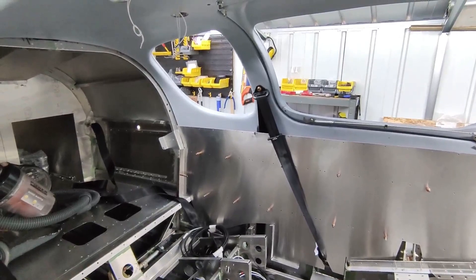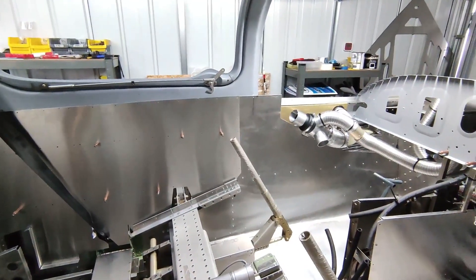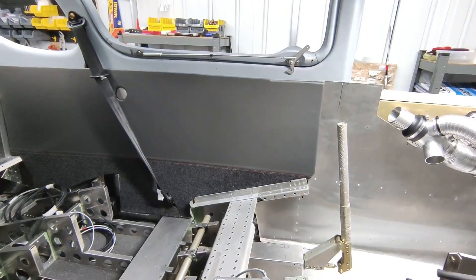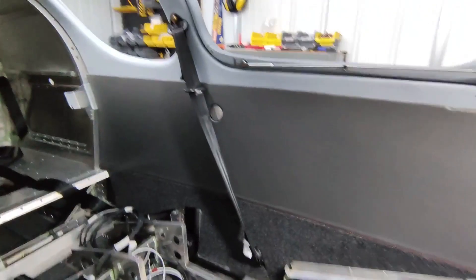Took a little bit of material off the bottom rear corner of the canopy, so now the internal skin can slide all the way back and it's a nice flush fit — perfectly aligns with the front inside skin, same on both sides. There's just a tiny bit of flanging on the section where the seat belt passes through the skin. Brought in the upholstery panel — the straight interior skin that goes on the inside — and marked the holes for the rear cabin heat vent. The Apollo upholstery surface looks really nice and it's a perfect fit.